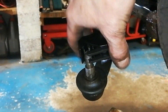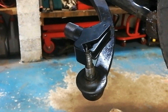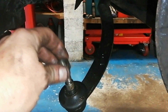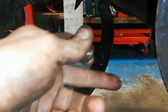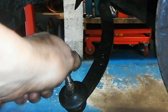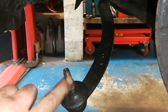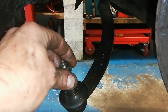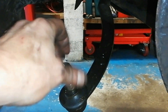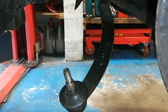The threads are cleaned up and I got another proper nut for that pitch of thread there, and I reinstalled it, running it up and down a few times. It's tightening up nicely. The damage was on the upper part of the threads, so the nut with the wrong threads was in the upper part of that shank. The nut will be held down where the threads were okay, so it was just getting it off that was the problem. The threads have been cleaned up with that wee tool and it's running up and down nicely.